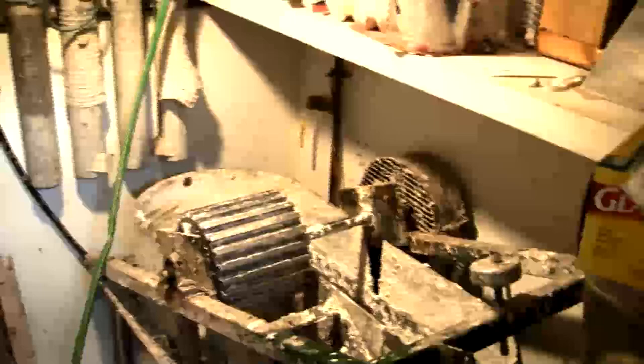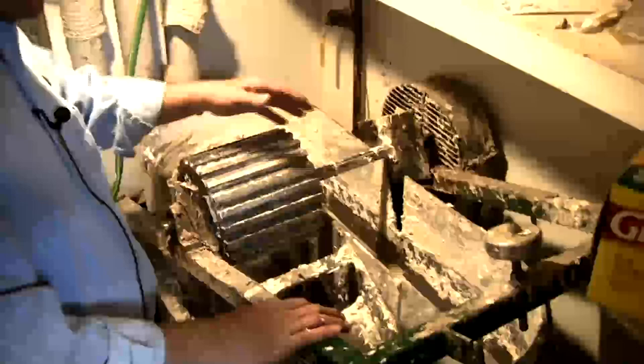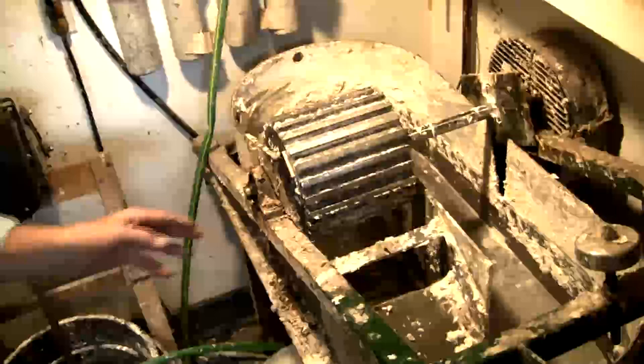This is a beater — the 20th generation of a beater that I had built for me when I was at CU. It's aluminum, with a really coarse roll with broad teeth that run against a set of bed teeth at about 500 RPMs in this trough. The water circulates around here, goes through the roll, over the backfall, and around. The design of the beater is such that the backfall controls the speed, the bed plate designs the beating, and then the teeth on the roll determine how it beats.